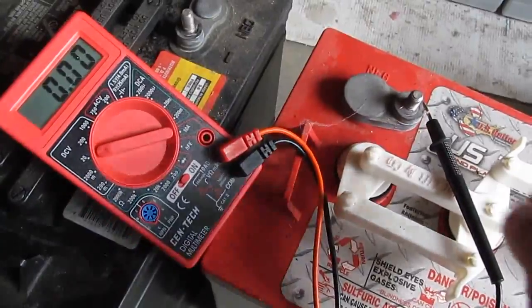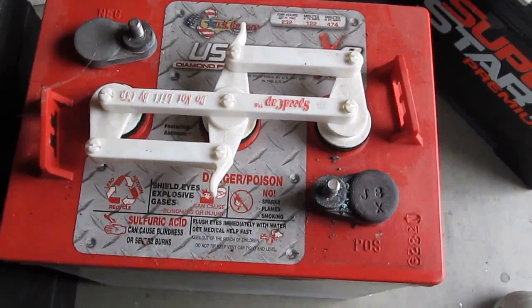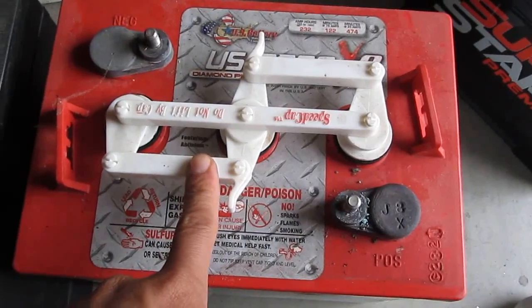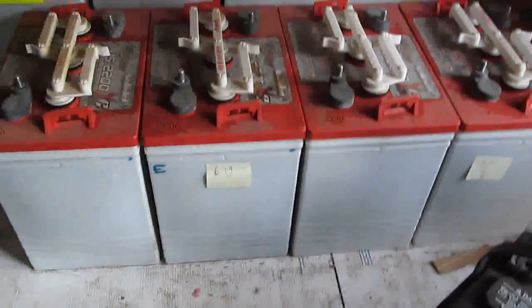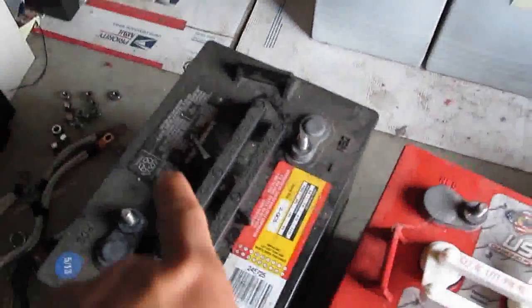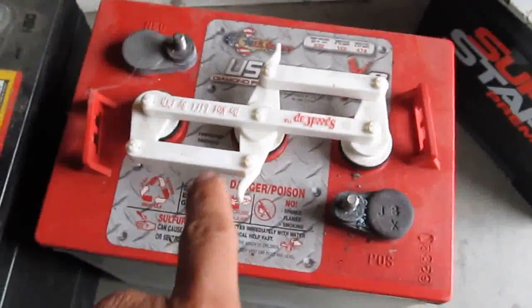So it's going bad. If one of these, instead of having 6 volts, only has 3 volts, it's lost 3 volts, right? So instead of my system being at 51 volt, now it's only 48 volts. So now this one can only go up to 3 or 4 volt maximum. When you charge the whole system, the charge controller doesn't know one of your batteries is bad. It still keeps charging at 51 volt, but since this one can only go to 3 or 4 volt maximum, the rest have to increase the voltage in order to reach the full charge capacity of 51 volt. So the rest of the system is going to be overcharged because of this.